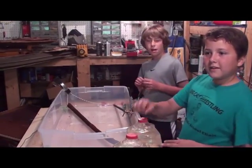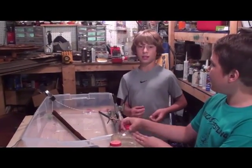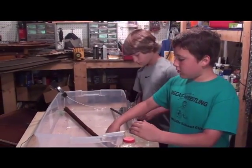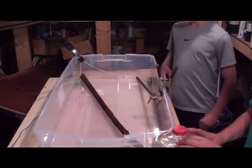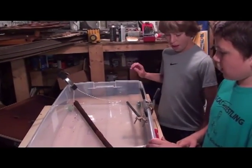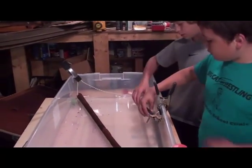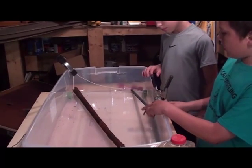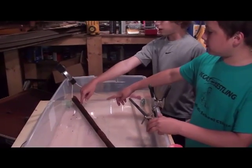Hello, this is Michael with Metal Detecting Virginia and I'm Trey Wright with Metal Detecting Virginia. I was doing electrolysis on what we think is a musket barrel found in the old creek bed while metal detecting. You're gonna get rebar and connect positive onto it, and then negative onto your object.